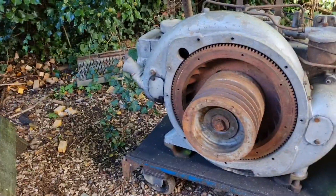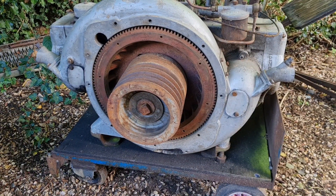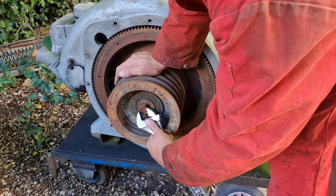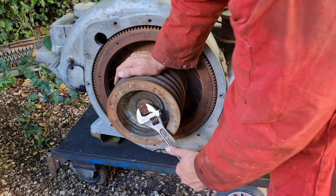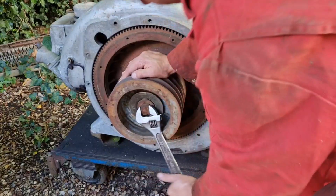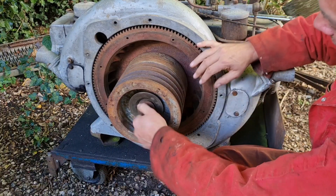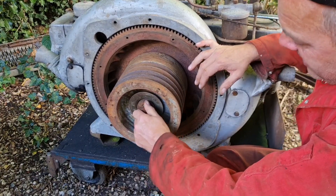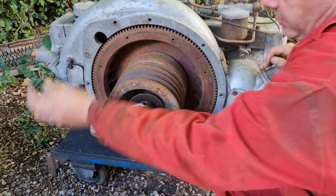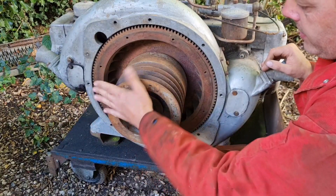So we're going to sit you guys down here. We'll get the old spanner out and see if we can get it undone — or is it going to turn the engine? Normally with these old engines, that's turning the engine. Did that go? That went, look! So let's see if this pulley actually comes off and see what's under there — just out of curiosity. I'm wondering if there's some sort of centrifugal clutch under there, which will be nice: when she's on tick over this won't be turning, and when you give her a rev up, this will kick in and turn wherever you want to drive.